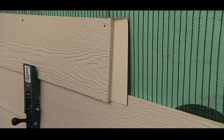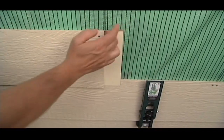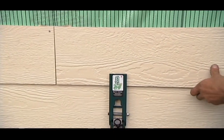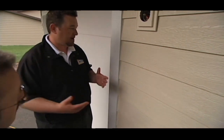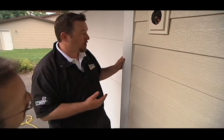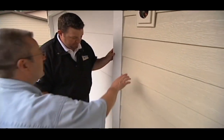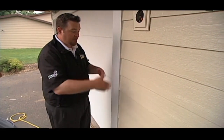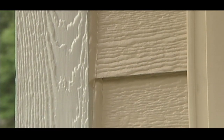A lot of companies will use just a piece of tar paper slipped in back there. With the color-matched aluminum slip sheet, there's a slight gap you're never even going to notice — it's going to last forever and really make the house look nice. The final step to finish off the LP SmartSide is the caulking, and we use the OSI Quad caulking color-matched to this diamond coat finish. When you stand back and look, you can't even see the caulking because of that color matching. Our installation technician did an awesome job making sure there are no bubbles and it all blends in nicely.